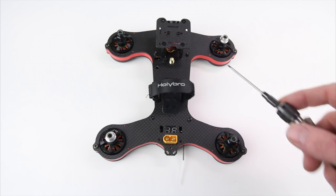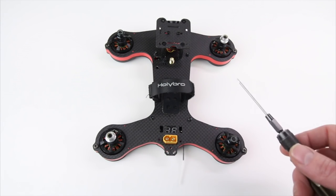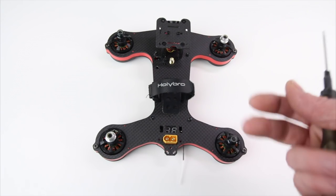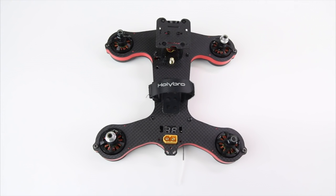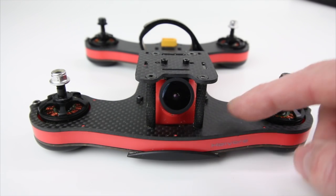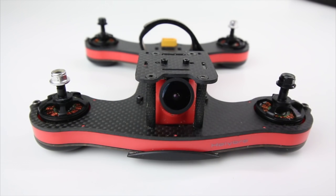Aside from the upgraded motors, you also get 30-amp ESCs in here that are also replaceable if you burn one out — I've seen other guys do maintenance on theirs and it is possible to swap in a new ESC. They're also set up in Betaflight and BLHeli Suite if you want to do programming and update them. Looking at it from the front, I love this low-profile design — everything is encased inside the frame, so ESCs aren't hanging out on the arms, which has proven to be pretty durable for both beginners and experienced pilots in crashes.